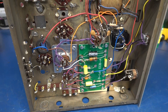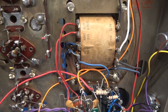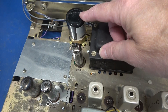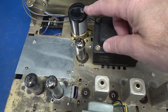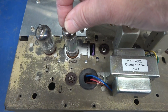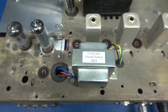I really enjoyed this build — this tuner was just asking to be a guitar amp, and of course the star of the show is that power transformer. Scanning the top of the amp: original power transformer, new filter cap — this is a CE Distribution dual 50 microfarad cap at 500 volts. The 6X4 rectifier tube is still there, and we have the added 12AX7 and 6AQ5 output tube, plus the CHAMP output transformer offered by AmplifiedParts.com.